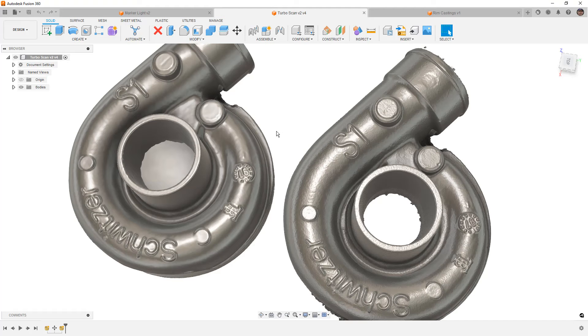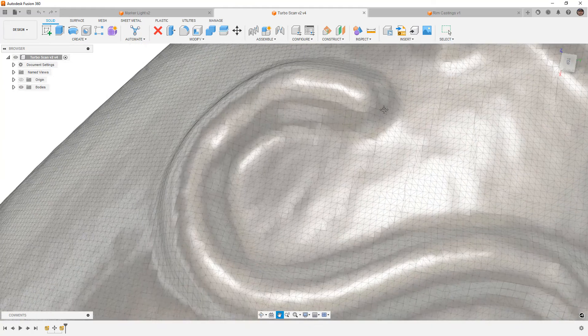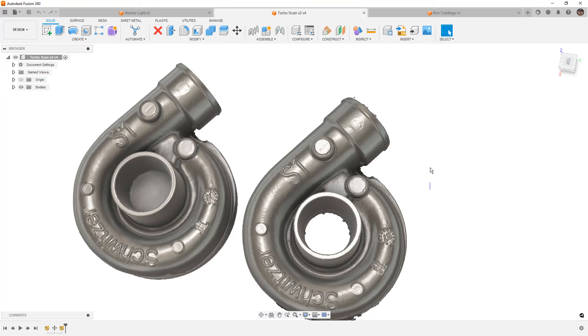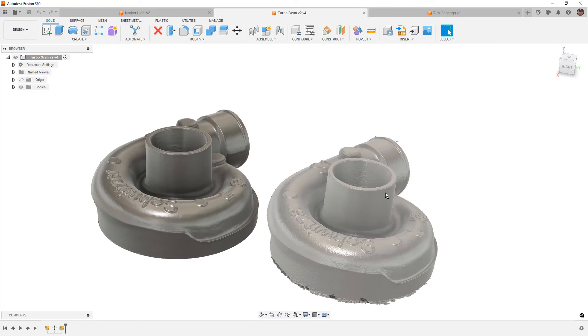It's kind of one or the other — you have to pick whether you're okay with losing some details for a cleaner mesh, or keeping the rougher details. Looking at the mesh elements zoomed in, we've got a lot of small triangles that really capture the detail pretty well. The center section is about 45 millimeters. I measured with calipers — keeping in mind it is tapered — and came in at about 45.6 millimeters, while the mesh sketch was coming in at about 45.5 to 45.55 millimeters. So within about 0.05 to 0.1 millimeters, though measuring a tapered cast part is not perfectly precise.